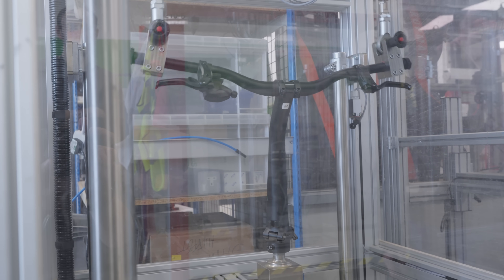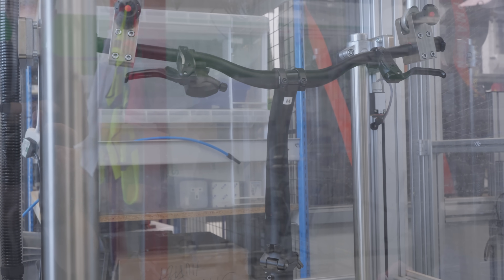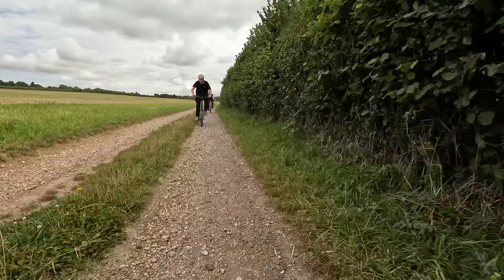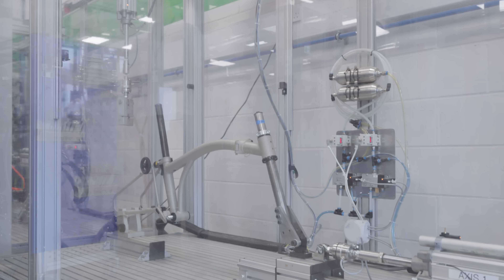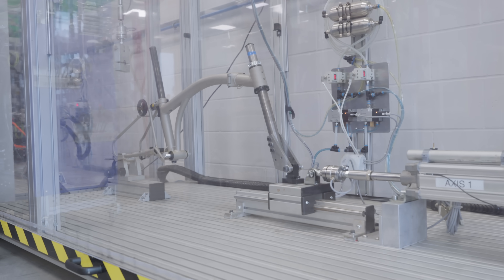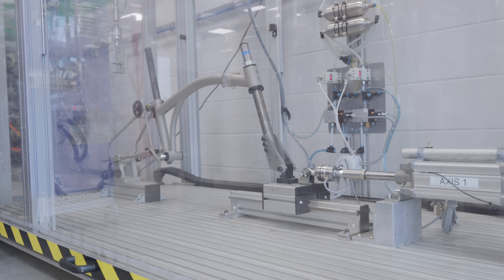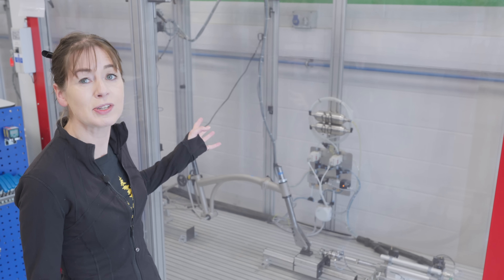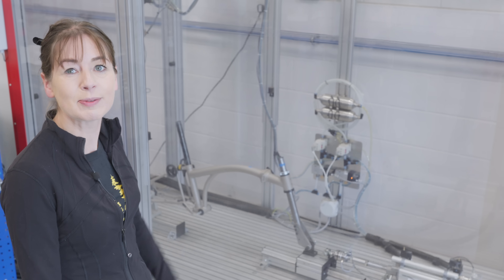Brompton tests to at least two or three iterations, or until it breaks. Look at that flexing — it's insane! It's replicating you standing up and pushing really hard, pushing and pulling, doing 270 newtons each side up and down. This testing is a bit like an accordion for a bicycle — it's replicating really heavy braking or going down a curb, applying 600 newtons front and rear. They have to do 100,000 iterations but regularly go up to 500,000. It's a really harsh test for this type of bicycle — it has no suspension — yet it passes repeatedly.